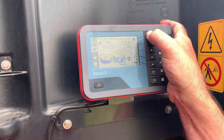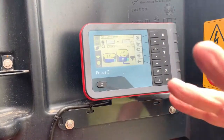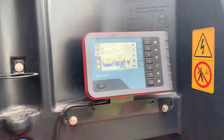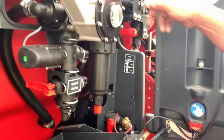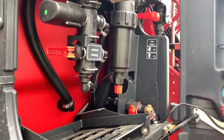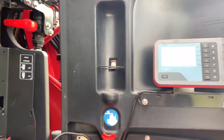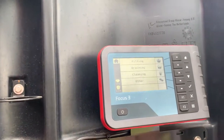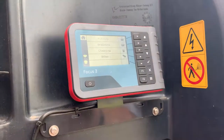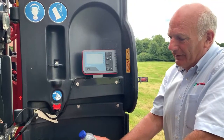Having done that, we connect the machine, connect the hose, press play, and you'll hear some valves move. Basically the valves have moved into a filling position - the valve at the bottom has gone to the external source for water, the valve at the top has now gone to work through the inductor and the filling system. Once we get near our amount of liquid needed, there will be an audible alarm to say it's nearly finished filling. If not ready, we can pause it, go back, finish off filling, and then take clean water into the tank.